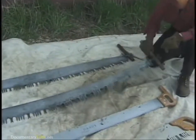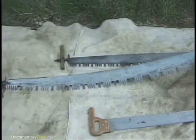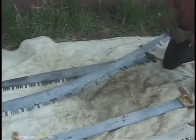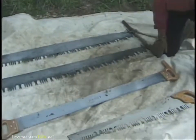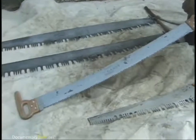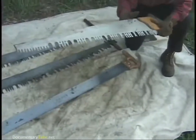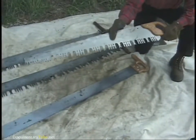This is a felling saw. It also has lance teeth. It's a felling saw because it has a swayed back and a thinner belly and it's a lot more flexible. This dandy saw has plain teeth — they're all little triangles — and it might work pretty well in hard wood. This one-man saw has perforated lance teeth and they'd work well in soft wood.